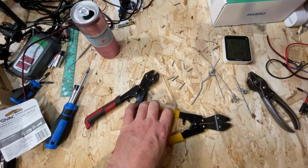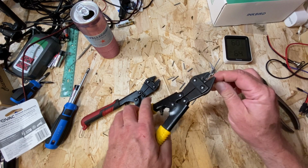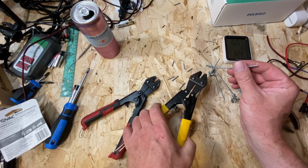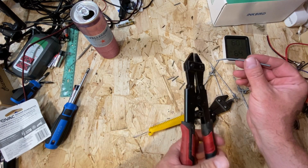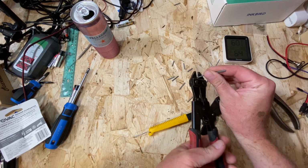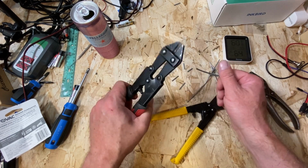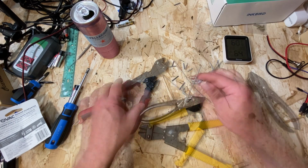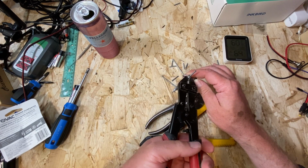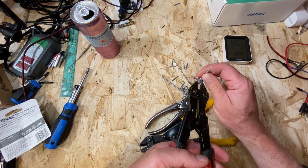After using both cutters on the first section of this fencing project, both cutters still performed about like they did when new. Both can still cut through 12.5 gauge high tensile wire with one hand if you're holding the cutters to maximize your leverage. Neither cutters show any significant wear or damage, and neither performs very well when attempting to cut wire with the tip. Both, on at least one occasion, allowed the tip of the jaws to slide beside the wire, resulting in the jaws closing without cutting the wire.